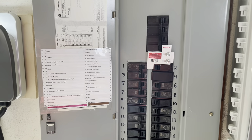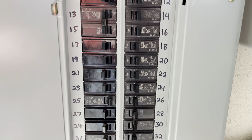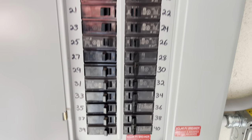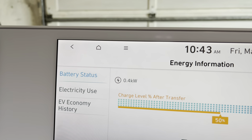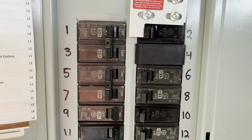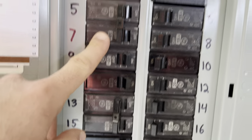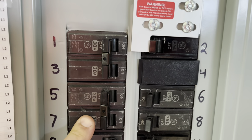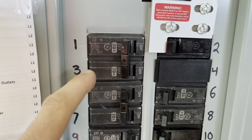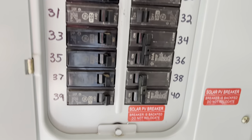From my solar software I know the house typically draws around 800 watts on an average day — less than half of what the V2L adapter can put out. By having all my general-use circuits connected to the V2L side, I should be completely fine. When flipping breakers on, you don't want to turn on any 240-volt circuits like the dryer — voltage can travel through one side of the breaker, through the heating elements, and come back on the other side. Keep all 240-volt breakers off while back-feeding the panel.